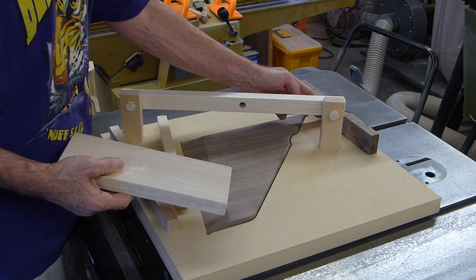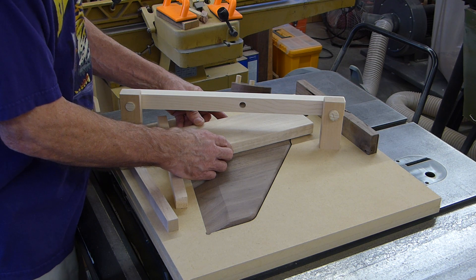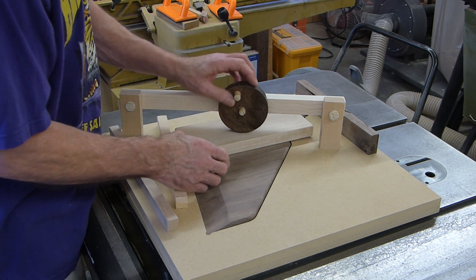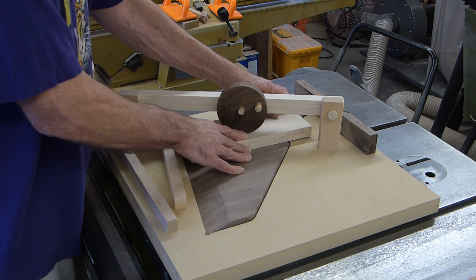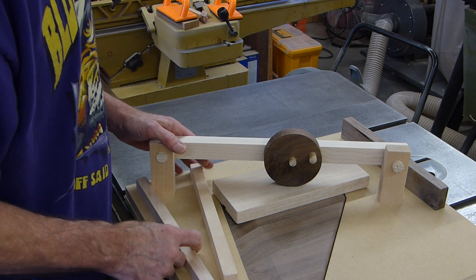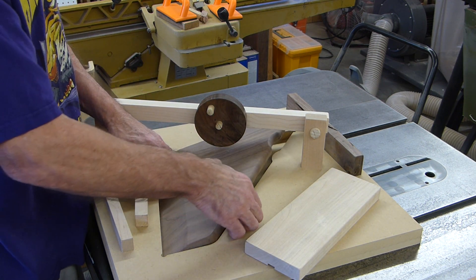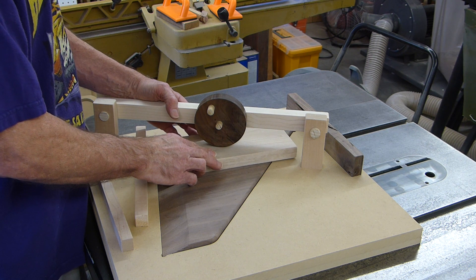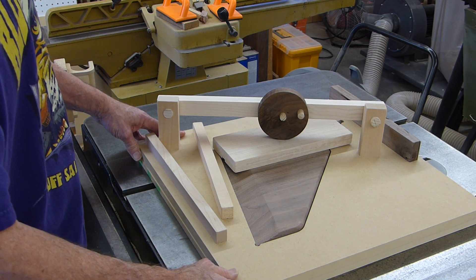So I've got a hold-down and cut a groove here where the blade will go, because I'm only going to raise the blade high enough to clear the top edge. Just like a crosscut sled, I'll cut through this and this, but I'll stop before I get to these braces. So that's going to go where the cut goes. This goes right here and just a simple cam — now it is locked in tight and nothing's going anywhere. So now I just put this against the fence, set it to cut an inch off, make a pass, take it out, put another one in. It should be just that simple. I say 'should be' because I haven't used it yet — but we'll go with it's going to be that simple.